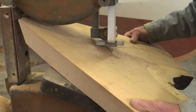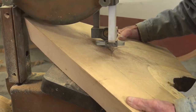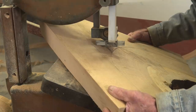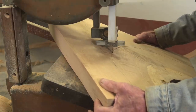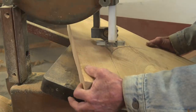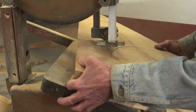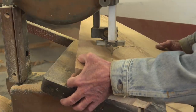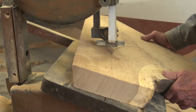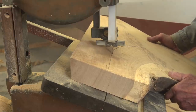Now I'm going to cut the radius right around, and I have to be really careful because if you drifted off that line a little bit, you could have quite a bit of work to do to get it smoothed out. You have to stay focused — you don't want to drift. Go around patiently no matter how good the saw is cutting. You don't want to cut fast, you want to cut accurate. It saves work later. And now you can see it's just 12 inches wide as it swings through the throat of the saw.